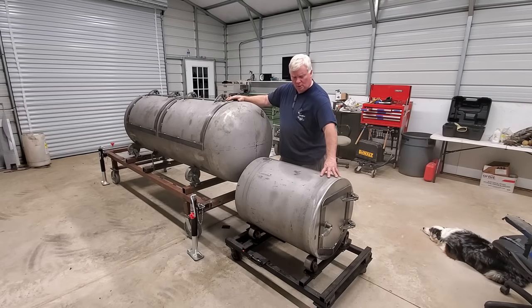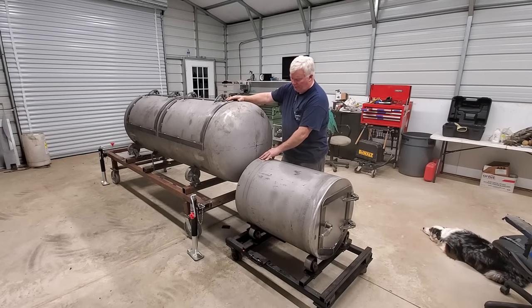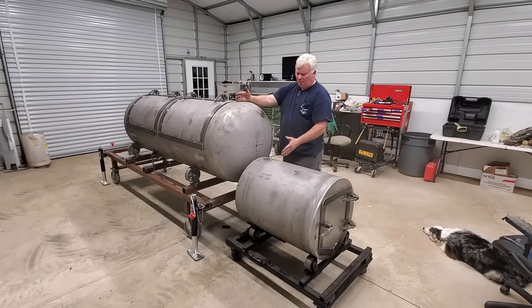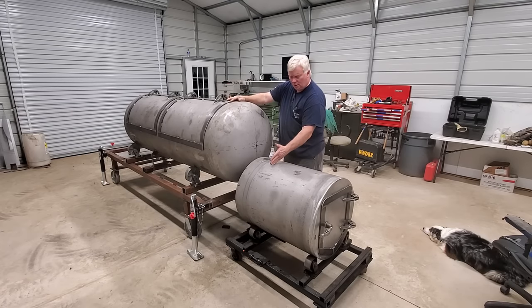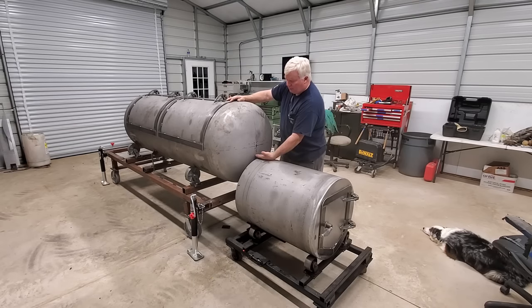It's a 31-inch long Firebox, and it's 24 inches in diameter. And it's a whopper. It's 3/8 of an inch thick, so it's pretty heavy. And it is going to set into this tank about 8 inches. The cap, or the head of this cook chamber, is about 8 inches, and I'm going to go all the way up just about to the vertical weld here, the cap weld. So it will stick in about 8 inches, and that gives us 25 inches sticking out. So not all of this is going to stick out. The trick is, though, how do we get it in the right position?